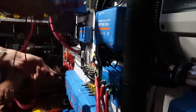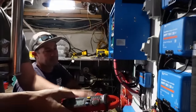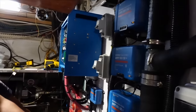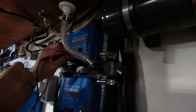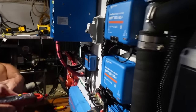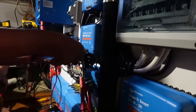This is the battery side. When we close these switches we'll be connecting the batteries to the battery bank. Should we start with the top one and check it? Smoke watch. We should see one set charging here — 14.14, coming off of this guy. This is seeing the battery voltage now to the charger, and if we watch for a little while we should see it start going up very slowly. Four out of four — all right, I like it. No smoke yet. So all the batteries are connected to the solar chargers.